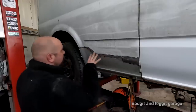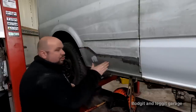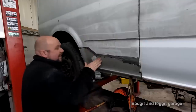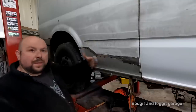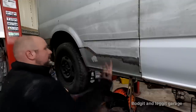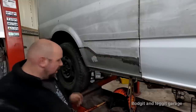But the good thing about doing the lap joint, which I've done, you can now see I've only spotted in a few spots, but look, it's so strong. The whole panel is moving. Missed. It's so, so strong, where if I was trying to do a butt joint, this would be a lot more flexible and potentially a lot easier to warp. Because of what we're doing, the way we're doing it, it being a van, we can get away with this. Loads of wax oil inside underneath, it's not going to be a problem.